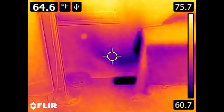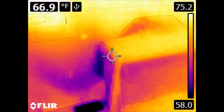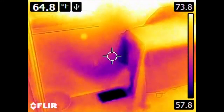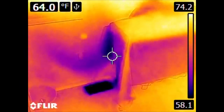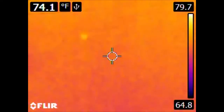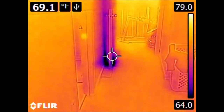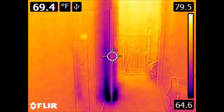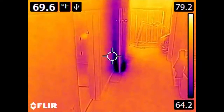Here on this wall we also have another air conditioning output. We can see the influence of objects around our vents — the air is cooling this wall and also cooling the side of this cover. If this cover were any further over, it would obviously interfere with the airflow and prevent the cooling. A better example of that occurs over here — the door stop for this door stops the door immediately over a vent, so the door is quite cool and the airflow constrained behind the door makes the wall quite cool, but it's not really helping the rest of the room.